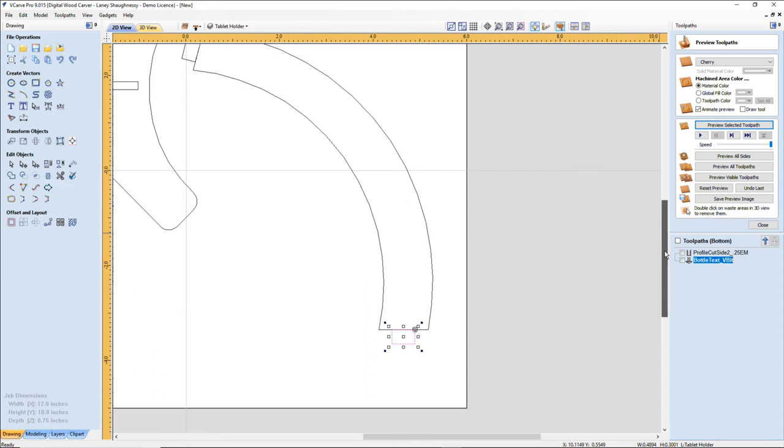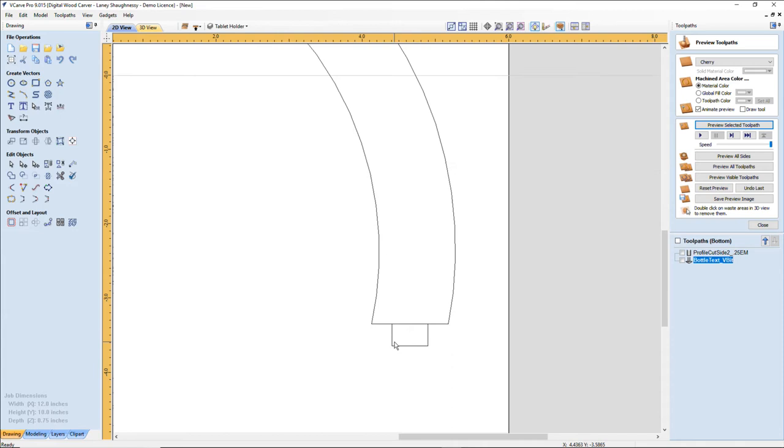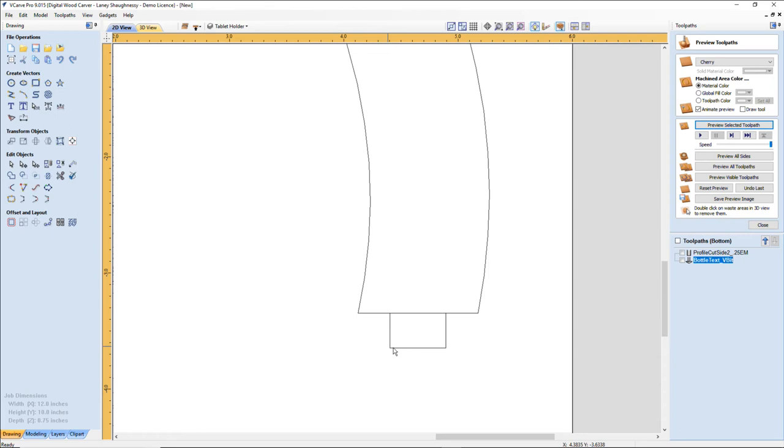Now, when these tenons get cut, because this is going to be a two-sided project and everything, there's going to be a pocket cut that is going to come and literally mill down this tenon. And so I need to create that boundary for the pocket cut. That rectangular boundary for the pocket cut that I'm cutting, because it's going to mill this down a very thin amount. I don't want it to be as thick as my material. I want it to be thinned out on both sides.